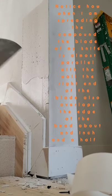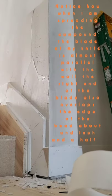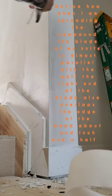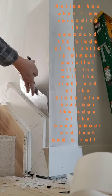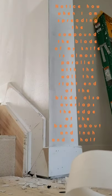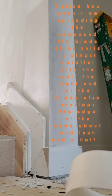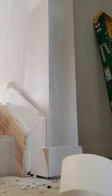Nice wipe from the side. Your edges. There's a little bit of tape there, so we put a bit more mud. Go with the angle of the stairs and wipe up. Here's our first coat, pretty much. Get the same on the other side here.